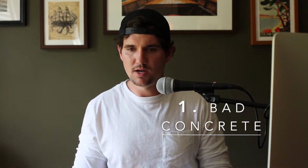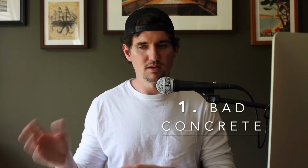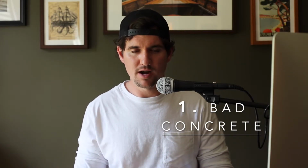So if you have bare concrete, maybe it was just poured 28 days ago, which is the time we recommend it cure before you put coatings on it, or maybe it was poured 10 years ago. It doesn't matter. If it was bad concrete to begin with, 10 years down the road, it's still bad concrete. So really simple to figure out, okay?